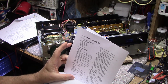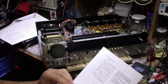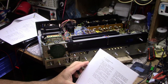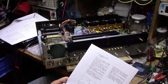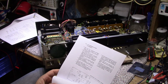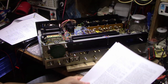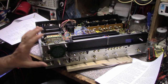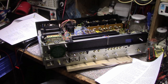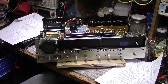I did have a dial cord come apart, so I might have an issue with dial alignment and tracking of the pointer. We still have to do the power amplifier adjustments — last time we just did a quick and dirty test to confirm all power amplifiers are working, and they are. Then we're going to do the CD4 demodulator alignment, and at the end of the video I hope to test a CD4 vinyl test disc I purchased on eBay — it's for aligning and setting up your four-channel decoder.